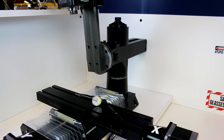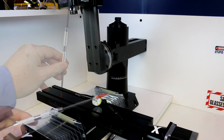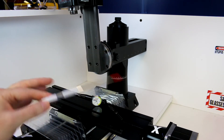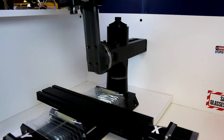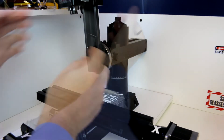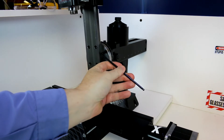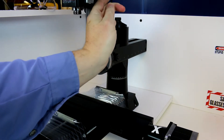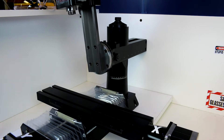Two of the key ones we need to worry about are the front to back tilt and the left to right tilt of our Z-axis. These are really going to affect our workpiece quality, alignment of holes, and doing multiple passes on workpieces. The next item I'm going to adjust — first visually, then using the square — is the tilt left to right. I purposely tilted this way off to the side, so I'm going to loosen up these four screws on the round plate. Before you loosen that last screw, make sure you have a good hold on the column or the head, because as soon as you loosen that, this is going to be completely free — you can just rotate it at will. Get it pretty close and loosely tighten those screws back down.